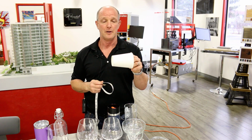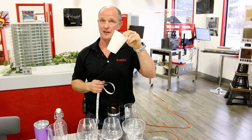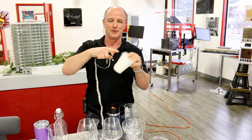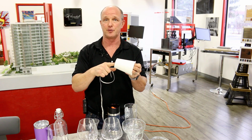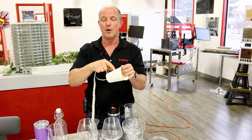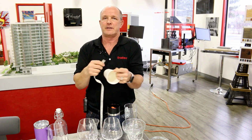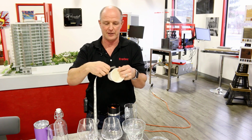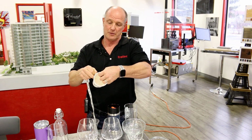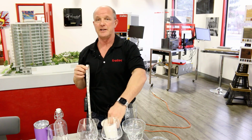paper coffee cup, but what you notice on this is there's a large discrepancy in the actual diameter. So a lot of times we can't measure up here or down here, because if I measure down here it's 2.25, if I measure up the top here it's basically 3.5 inches. Well, if I want my logo from here to here, I really can't measure the top or the bottom. I could use the caliper, but I could also just come all the way around here and go, okay, I'm at 9.25 inches. So again, something like this typically works quite easy too.